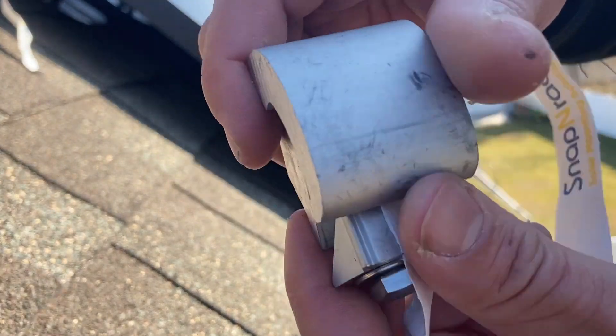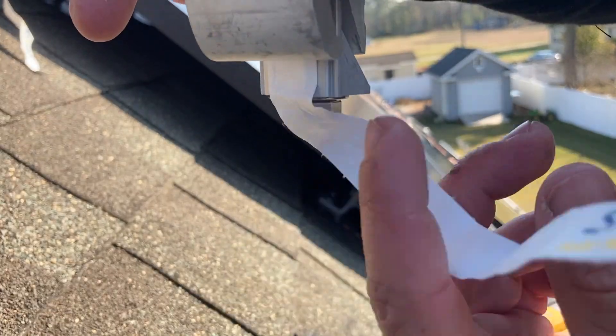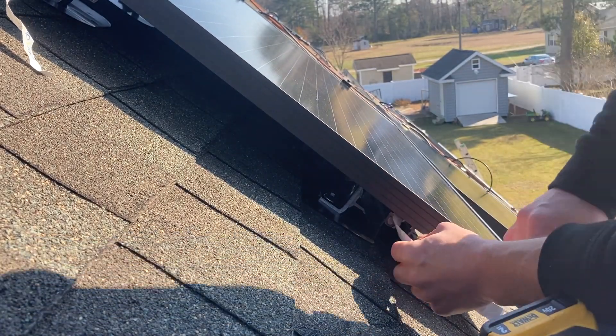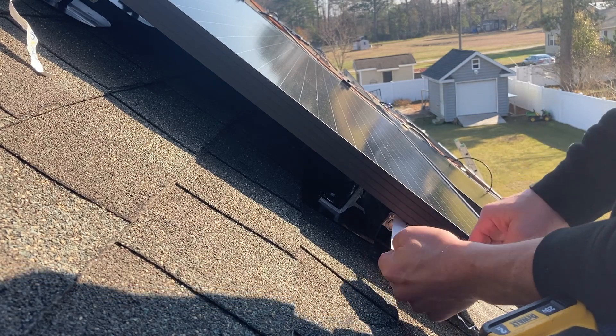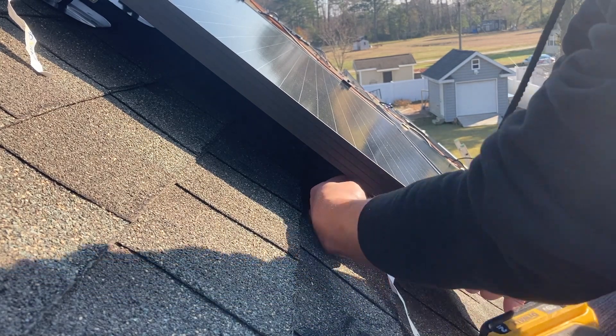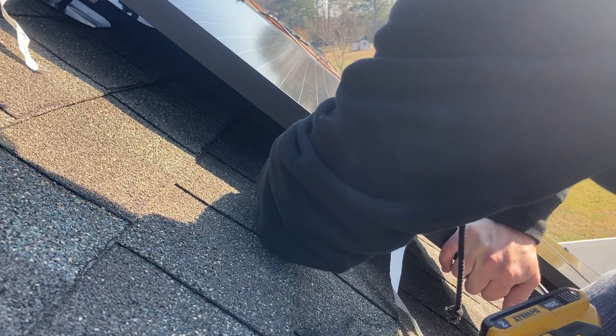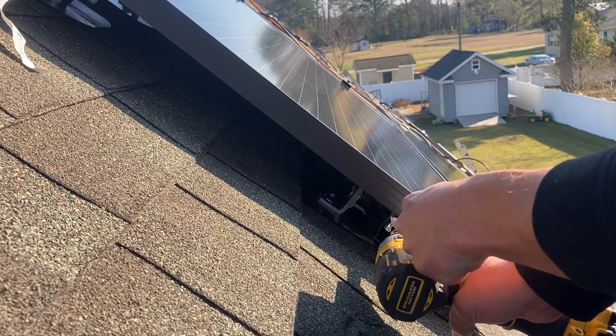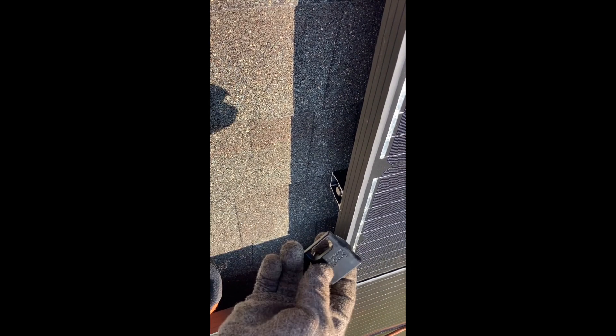Here's one of your end clamps — goes in the end of the rail, push it back and get a little tab, pull it back. You might have to go in and lift it and pull it back. Here's one of your end caps — what's nice about this is it makes the end cleaner and better-looking, covers up the bolt. To get it in, put it at an angle right here and best use a hammer.